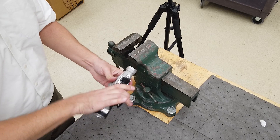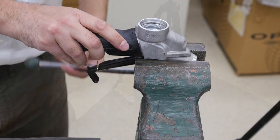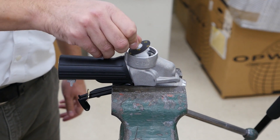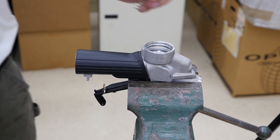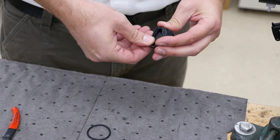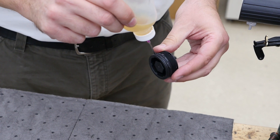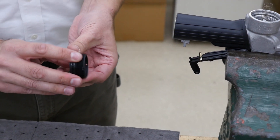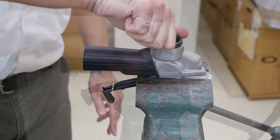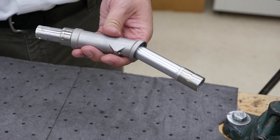Remove the nozzle body from the vise and turn it over to install the lever assembly, pushing the post of the lever assembly gently through the seal. This post should engage the stem assembly. Place the nozzle body back in the vise and install the diaphragm assembly with the rollers orientated towards the inlet of the nozzle. Then place the vacuum spring on top of the diaphragm. Lubricate two new o-rings and install them on the vacuum cap. Tighten the vacuum cap until snug. Before installing the spout, be sure that you replace the o-rings inside the nozzle body with new lubricated ones.